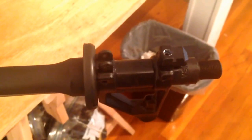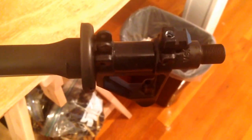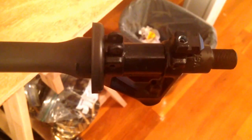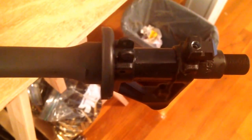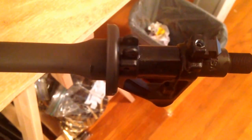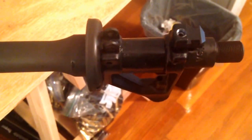They're finished, they're lock-tited, they're not perfect but they're solid — that isn't going anywhere. I checked it with my laser bore sight: with the rear sight windage centered dead in the middle, the dot was right dead center at about 25 yards, so I'm confident I'll be able to sight it in no problem. For seven bucks or less, it was a fairly easy DIY job — way easier than trying to drill for taper pins and pin them in, and definitely a lot quicker. If you've got it all set up and aren't trying to videotape, you should be able to do it in less than 20 to 30 minutes. Thanks for watching.